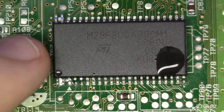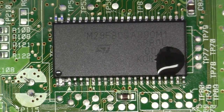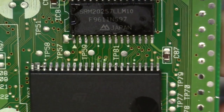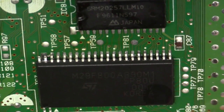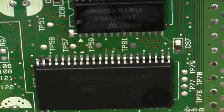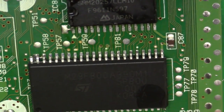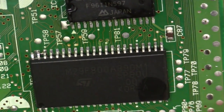I'm going to flux that in and solder that in. That's done. This chip is fairly well anchored. And now that I have this chip pretty well anchored, I want to do one final look, and I'm going to rotate this up so you guys can see, in better context, what I was talking about. Notice how I bent the pins inward so that they will make contact with the pad landings. It's really that easy, and it's perfect alignment.